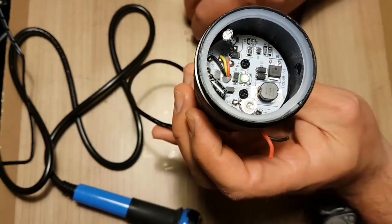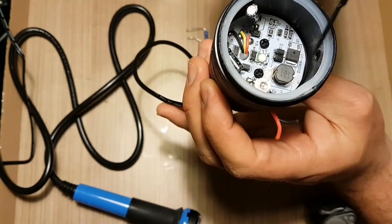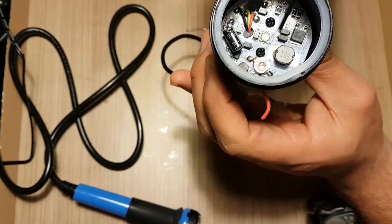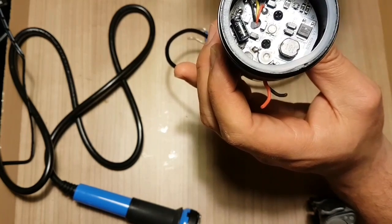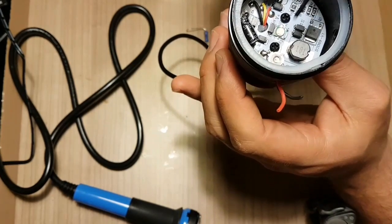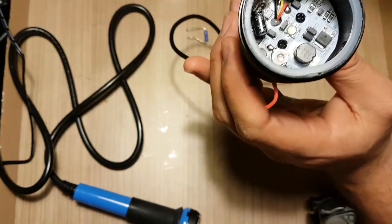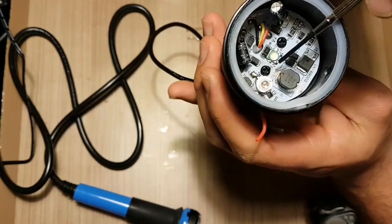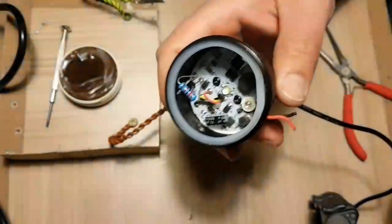The second problem is with the red devil eye — you can't unsolder it or cut it out. Whatever you do, you need to leave it on, because if you cut it out you won't have any power for the LED angel lights. I could use a 22 ohm resistor to simulate the LED light, but I'm not that good with electronics and I'm not sure if it will work, so I'm just going to use some heat shrink tubing and put it over it.